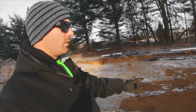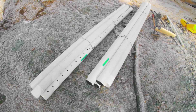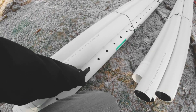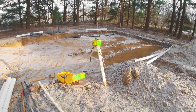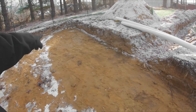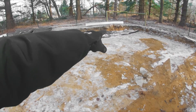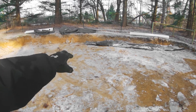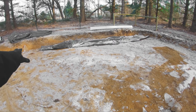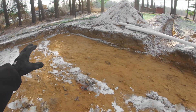In the trench coming from the septic tank, it has to be Schedule 40 PVC, and then once you get out into the field you flip over to drain pipe. This is the drain pipe - thin walls, very light, black interior. This is solid pipe, not perforated. Then we have perforated pipe. We're going to build a header across the field using solid pipe to distribute water to fingers that run down the drain field, and then there's a footer that ties all the pipes together at the end. The header must be solid non-perforated pipe for distribution; all the fingers and the footer are perforated pipe.